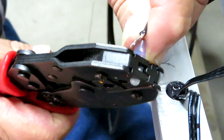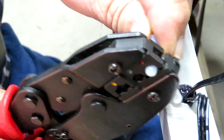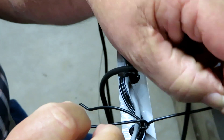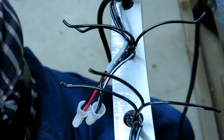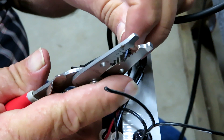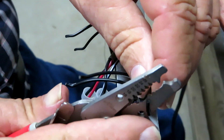I solder all my joints considering they're going outside. Because we live in Florida we have a lot of condensation and rain, so I'm putting caps over the joints just to protect them. The next thing we have to prepare is each one of the wires for the data line — the three wires on the WS2811.